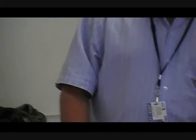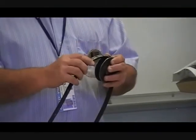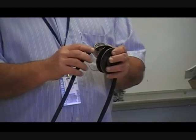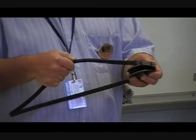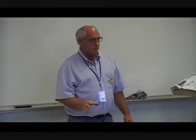Just because you have a belt that seems to fit correctly does not mean it is the right belt for that application. When replacing belts, you'll see a lot of people that will just pop them on. If you've got to stretch that belt to the point of forcing it, you've probably ruined the belt because these have cords in them — if you break that cord, the belt's not going to last. I do see the application of belt dressing from time to time. I don't like that because it is a very temporary fix. If you have a belt that's slipping, either the pulley has gone bad or the belt itself has gone bad.